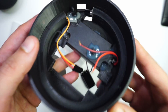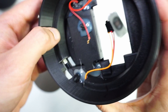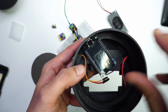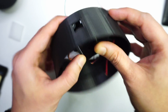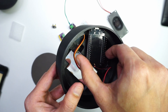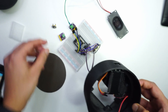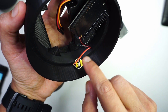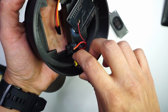Now I've cut this section and the cover is sitting flush inside with no gap for the light to bleed out. Putting the ESP32 back, it sits perfectly — this also helps level the USB-C port. This takes care of the LED part and all the connections. For the microphone I have this small slot here, and I'll position the microphone so this hole allows the microphone input.